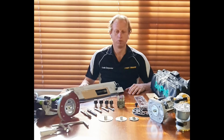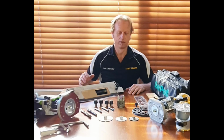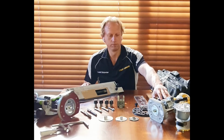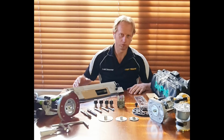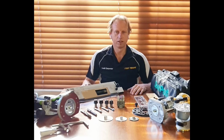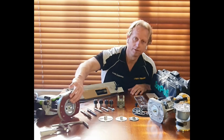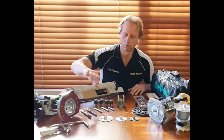You'll be fully capable once you have all the collets, all the cutters, the copy rings that you need, and preferably 2 routers. I say 2 because a smaller one like this will do most applications, but then when you need to plunge deeper, you need a larger size one. Now the challenge is, every router base is different and they hold different size copy rings. Festool, for instance, they supply their own, but they don't use a 16mm copy ring, which is what we're working with.